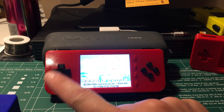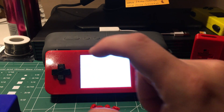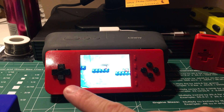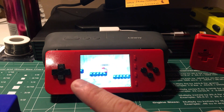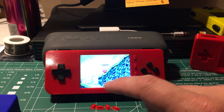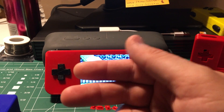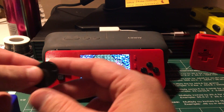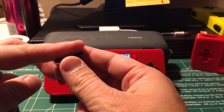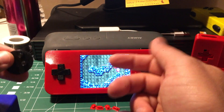The gamepad PCB on the d-pad — to fit with the screen size — was really tight. I didn't want to extend the case any further than I could, so I essentially crunched it in and it sits a little bit above the screen PCB. What I ended up doing is putting NinjaFlex on the back of the actual d-pad knob, and then you'll actually have to put some masking tape down — I put a couple layers, two or three — and it just helped with the separation between the PCB pad and the d-pad.